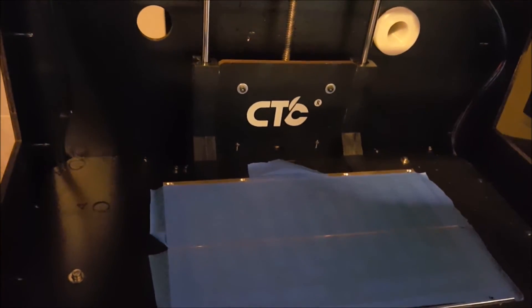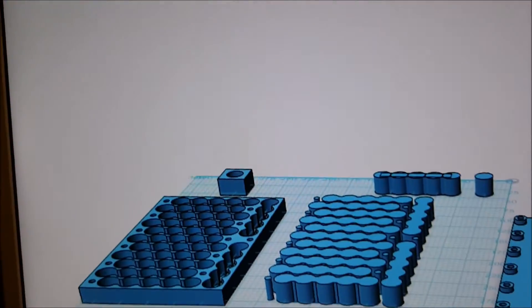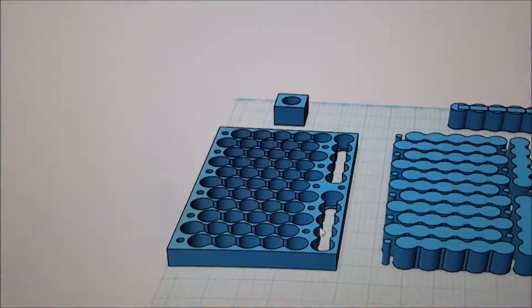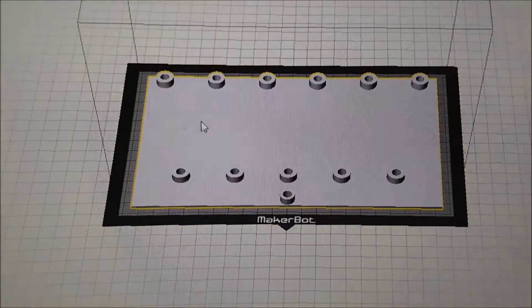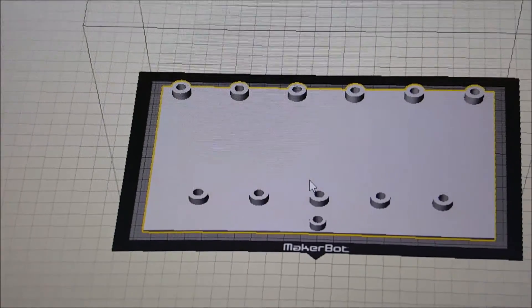Here's a quick shot of the 3D printer. The software I'm using is Autodesk 123D Design — it's a free Autodesk product and it's not too tough to use. You can see the actual object that I designed. I build it here, then export it as an STL file and print using the MakerBot software. This here is a cover for the battery that I haven't shown you yet.